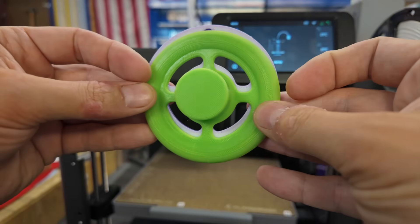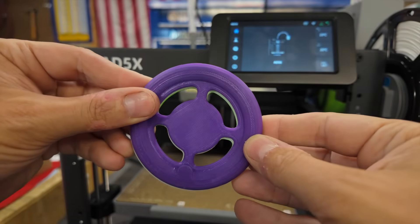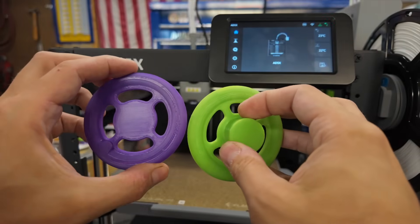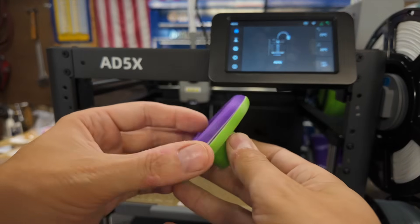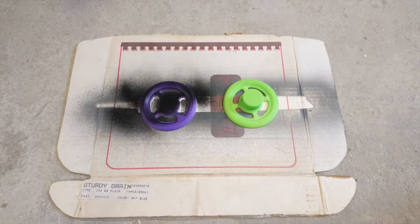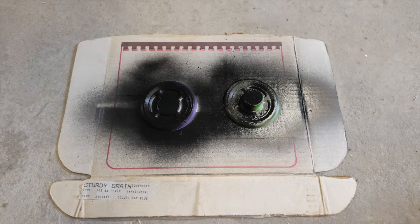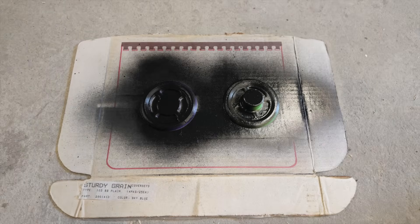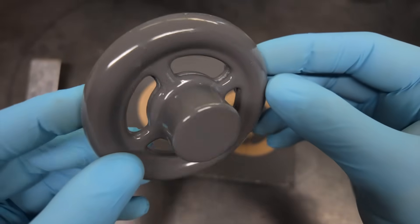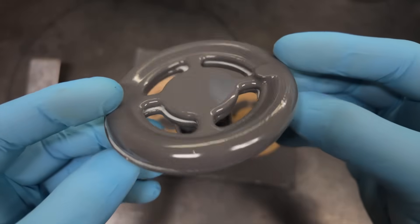Here is a look at the finished pattern — I think it came out really, really nice. However, before we can use it as a casting pattern, we need to get rid of the 3D printed layer lines. The casting sand can stick to those layer lines and make it difficult to release the pattern from the sand. The easiest way to do that is to cover the entire pattern in several layers of spray paint. It takes a bit of time because you need several layers and need to wait for the paint to dry, but it's worth it — you end up with a really nice, smooth texture all over the surface.